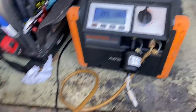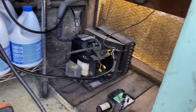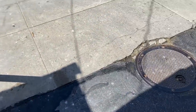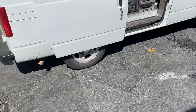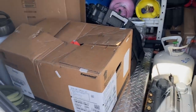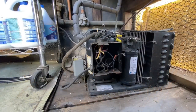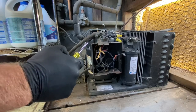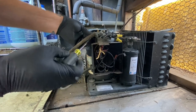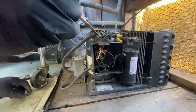We got the dirtilator going. The refrigerant on that one did not smell too good. I don't know if I have an acid checker or not, I'm going to take a look. It was not smelling good — possible burnout. I've double-checked with my meter to make sure the switch was a two-pole, because it looked like a single pole switch.